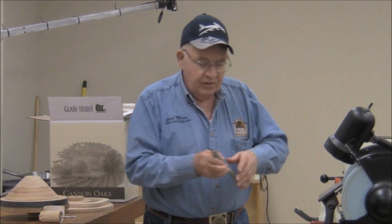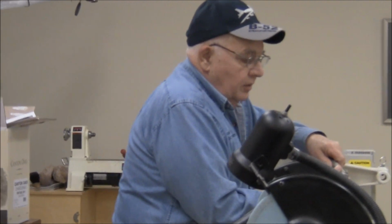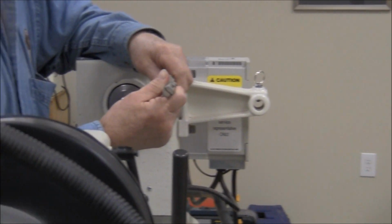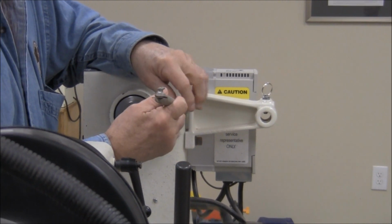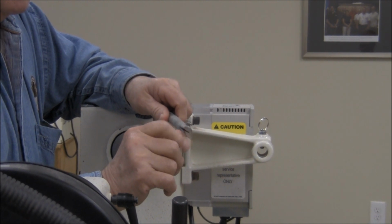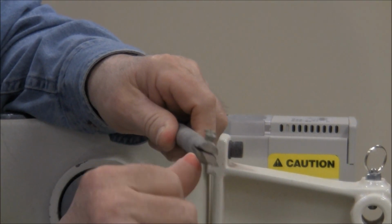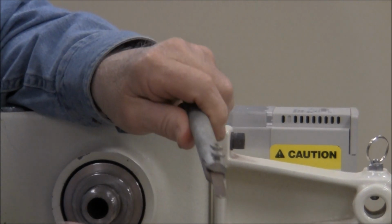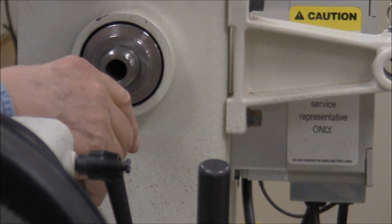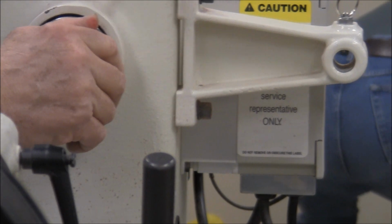One thing that was mentioned was the chatter tool. Jane Bridges came by one day and brought the rod and wanted to make some chatter tools. And this part here is from a 1-inch wide bandsaw blade that I used. To use this, you hang it off the tool rest like this. You get it like this,